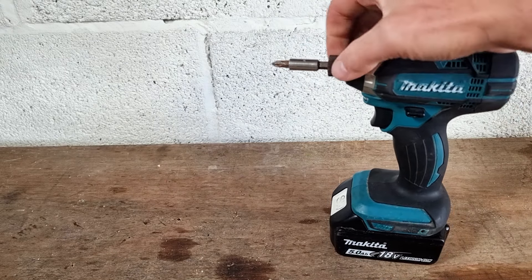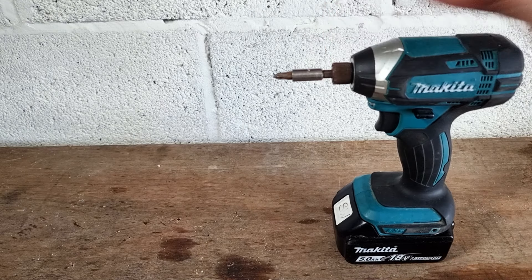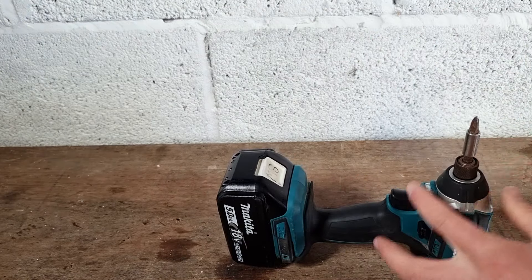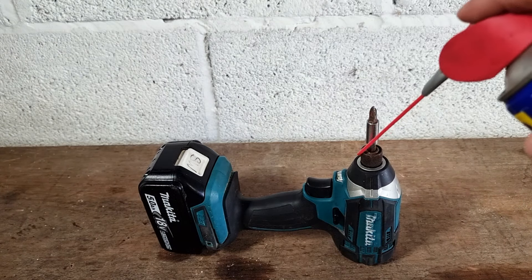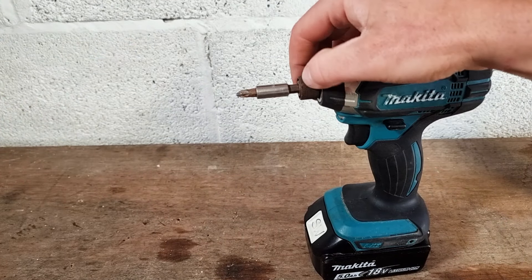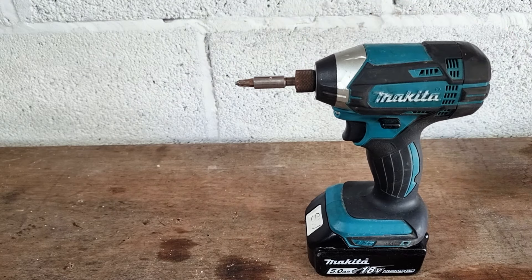So we've got a collar here, and that needs to be pushed forwards. If that's seized up, then you need to try and find some way of releasing that. The first thing you can try is to spray some WD-40 around this rim here. If you spray that around there and just leave that to soak in, it can often release this little part here. In order to release the bit, you do need to pull that collar forwards — that's the first step you need to overcome.